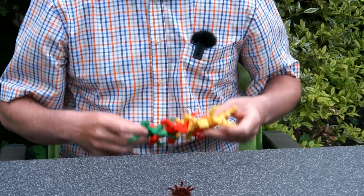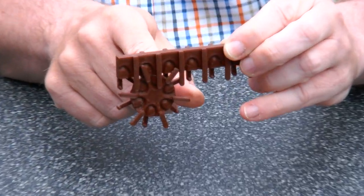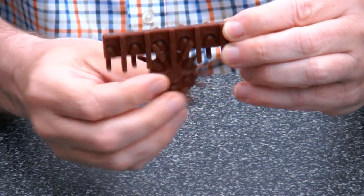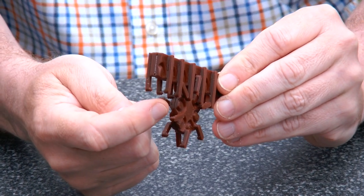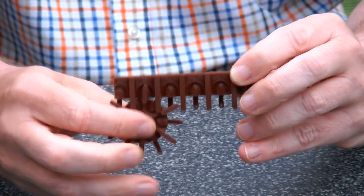Instead of using gears, I did a rack and pinion mechanism. What you see is that the gear hangs from the rack — or the rack hangs from the gear, depending on how you look at it. They stay together because of subtle details: there are some pins that are guiding in grooves, so the only place where the part can come off is at the side.